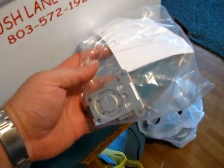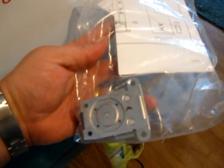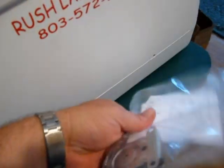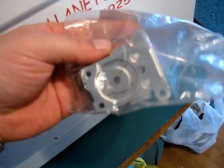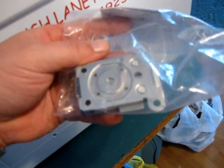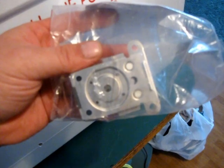If you're going to use a water heater thermostat, this is what you're going to get right here — get it from Lowe's. This is the upper water heater thermostat; this is what I use in several of my incubators. If you're using this, it's going to mount in the same spot as the GQF. I'm going to pull this out of the package and give you a better idea of how I would mount this.